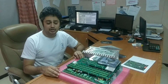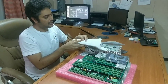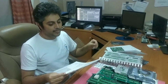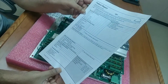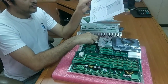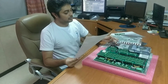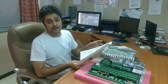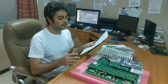Once the MPC completes its shelf life, you have to land it back to MAN. MAN has a procedure for landing damaged MPCs — any failures should be reported and the MPC landed for reconditioning and study to determine if it can be brought back into service. Every MPC also has a serial number. When you have to replace an MPC, convey all relevant details to the maker and follow his instructions. This comes as a critical spare when the engine is delivered, and should preferably be kept in the chief's cabin, stored in a cool and safe environment.